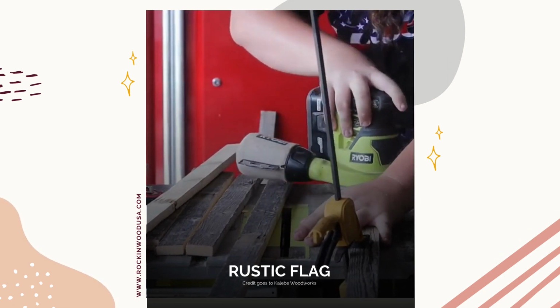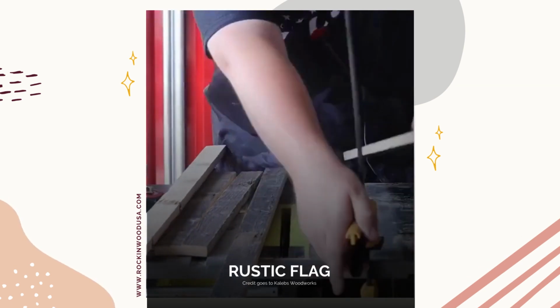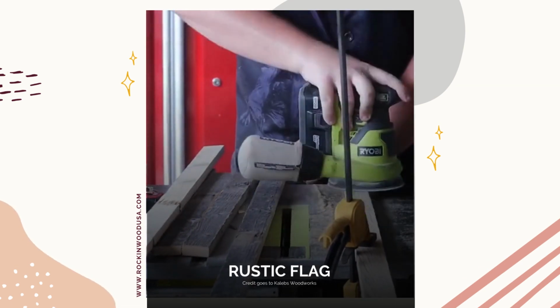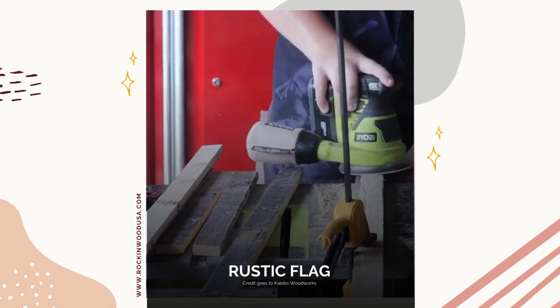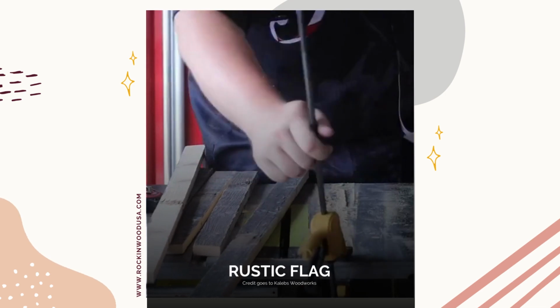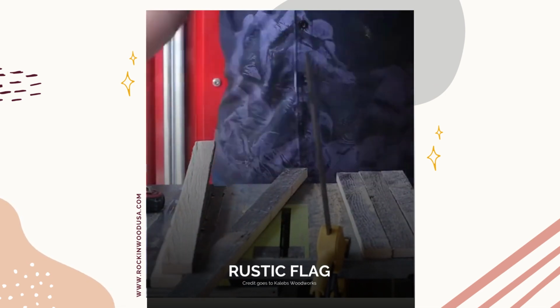I started off with 60 grit, moved to 80, then 150, and finished it off with 220 grit, just to give it a smooth finish for the white stripes. Next video, you will see the process of putting it together. It's going to be a small section, very simple.